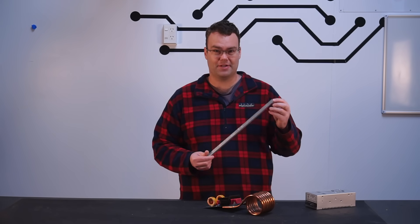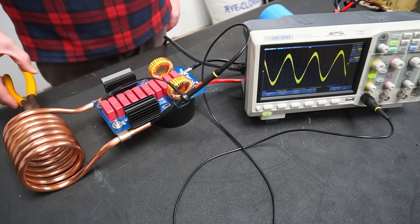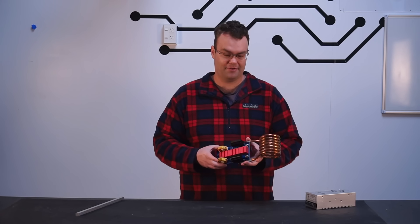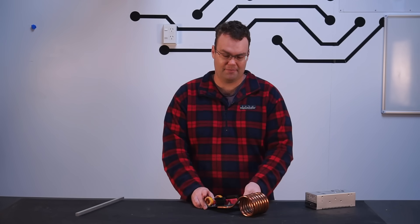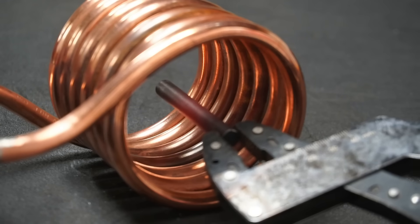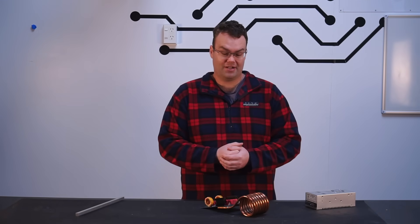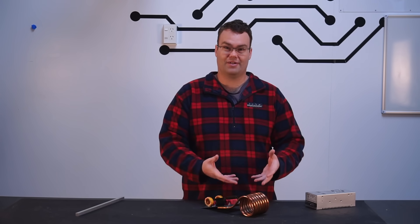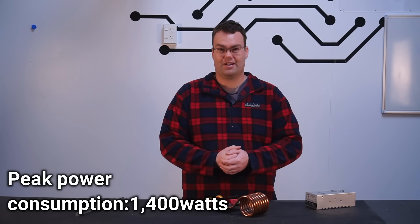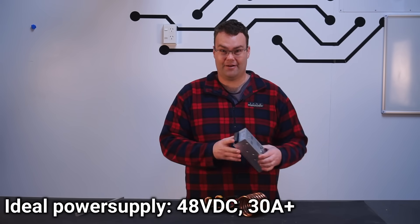To effectively heat non-ferrous metals such as alloy really requires two major things: a far more powerful induction heater, and the frequency at which the coil resonates plays a major role in efficiently heating non-ferrous metals. So really this induction heater is suited for heating ferrous metals only. When it comes to choosing a power supply voltage, I recommend going with 48 volts as it yielded the highest performance. Current draw will largely depend on the size of the metal you're trying to heat — I was able to draw a maximum of about 1.4 kilowatts from the wall.